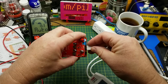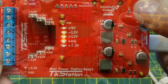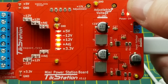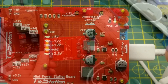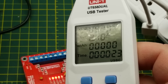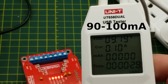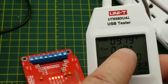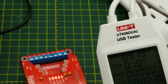Plugging into the USB-C input, we get a whole bunch of LEDs lighting up. When you turn it off, the minus 12 volts takes a while to fade out, which means there's some capacitive smoothing on the output — a fair bit of capacitor smoothing. With no load it's drawing about 9 or 10 milliamps, and it's going into Power Delivery mode — bumped up to the full 9 volts from the supply.